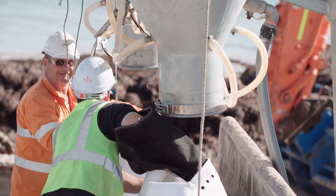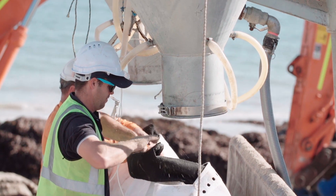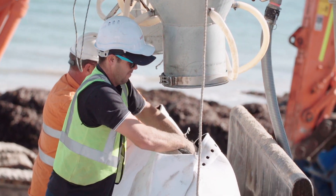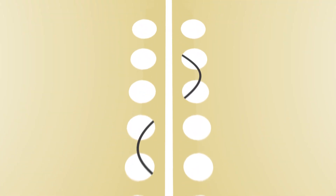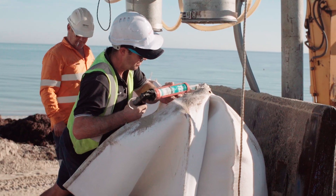When closing an Elcorock bag, release the clamps holding the trunks and roll the trunks inside the bag. Secure the pre-manufactured holes using cable ties, lace the opening with the supplied cord, and complete with a double reef knot and a generous amount of silicone.